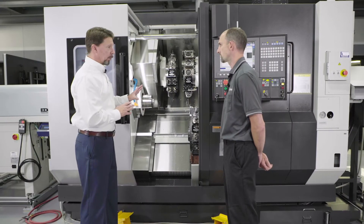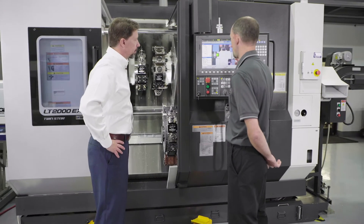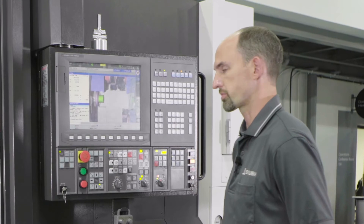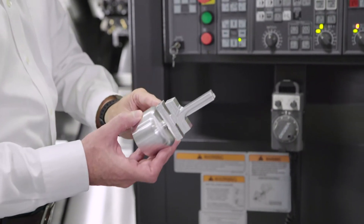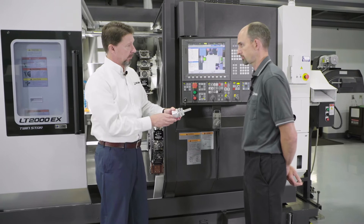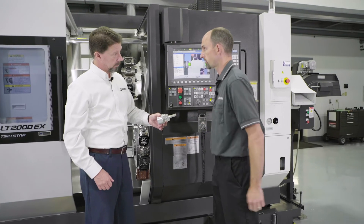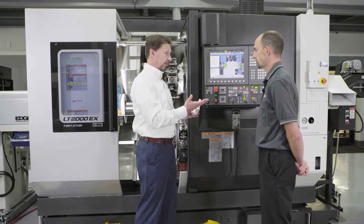This is a very busy machine — a lot going on in a small amount of real estate. What do we do to help protect the machine from itself? The LT Series comes standard with CAS, which is Okuma's Collision Avoidance System. This gives us a real-time model of what's going on in the machine — it's going to monitor your cutting tools, your work material, and your spindles, and stop the machine before any damage is done. We had a couple of short end mills coming in to pinch mill some slots, and CAS caught that two adjacent tools were longer and would have collided. Luckily CAS caught it for us and saved us from any accidents — something we didn't catch in initial setup but collision avoidance caught after the fact.